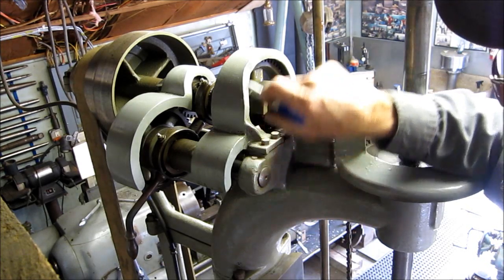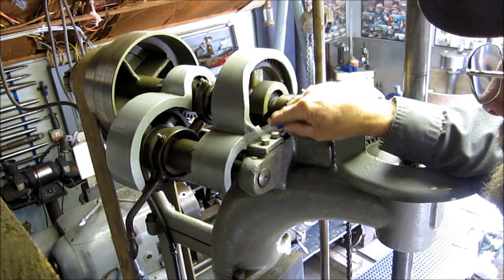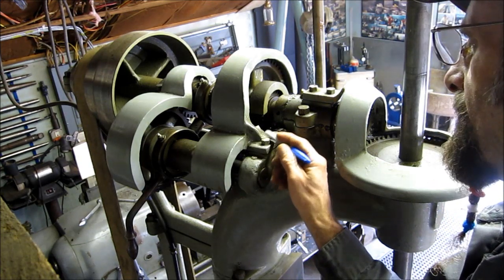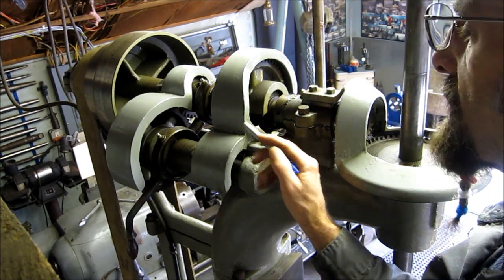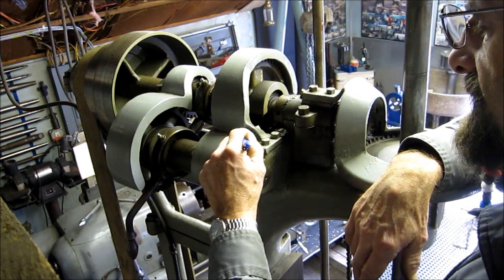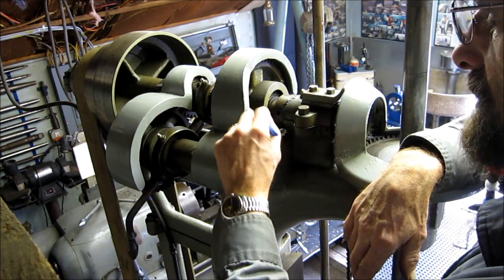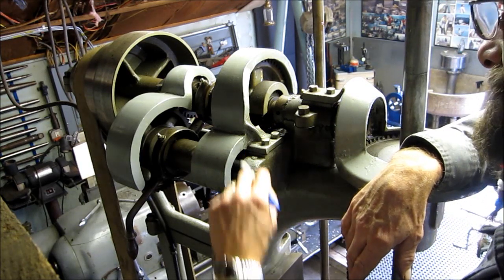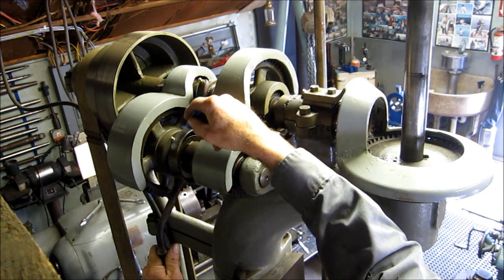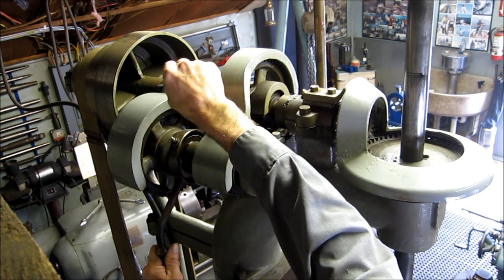Here we're on the other side of the head, so you get a chance to see from up above both sides of these shields that I had to make because they were missing. This area right here was left with just these two original bolts — it was broken off right there, and the other mount was similar. I did a two-process approach: I created these pieces, silicon bronze welded the seams, shaped everything out, then brazed the cast piece to the steel. Some of the paint wasn't 100% clean due to the flux, but they're rigid and strong. I created a half yoke and a full circle yoke with pivot points to each of these rings — one on the main shaft and one on the back gear shaft.